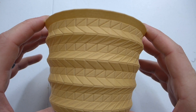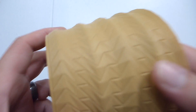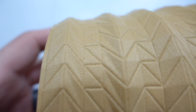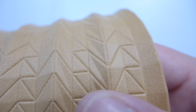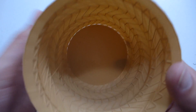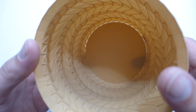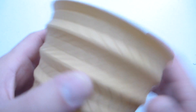This is kind of my favorite pot to print right now, especially in this wood filament, and it turned out really nice in vase mode. Seeing layer changes or where the layers are is pretty much impossible — it turned out really nice. Looking at the bottom, it filled in most of the way, but right along the bottom there you will get a little gap. I think I just need to up the extrusion multiplier in that lower part and do a multiple process to get it done, but I've noticed that with other filaments too.